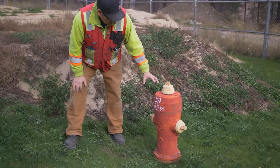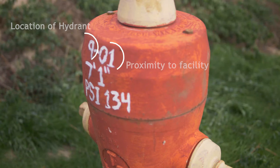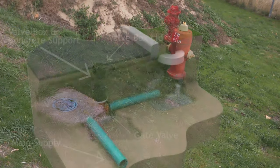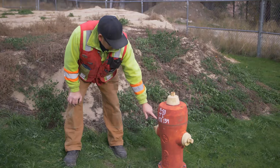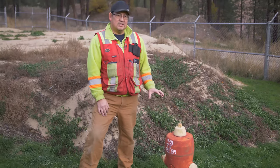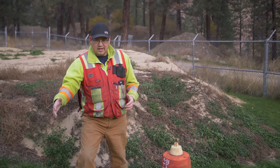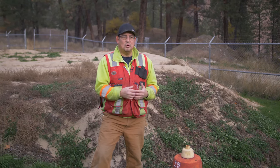We're on IR number nine, this is hydrant number one, only because it's closest to the water plant. The seven foot one inch is the location of the main shutoff valve that isolates this hydrant, and then how much pressure we're working with — 134 PSI coming out of this hydrant. That tells our operator where the isolation valve is and how much pressure he's going to be working with, so he can take the appropriate precautions.